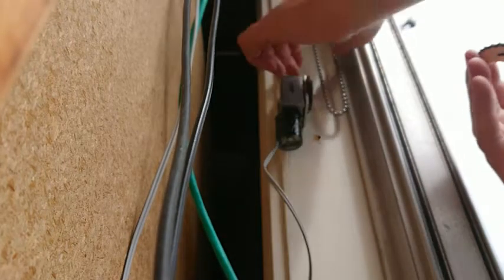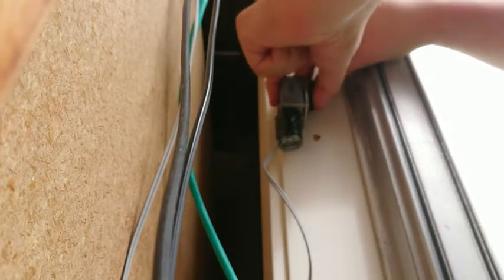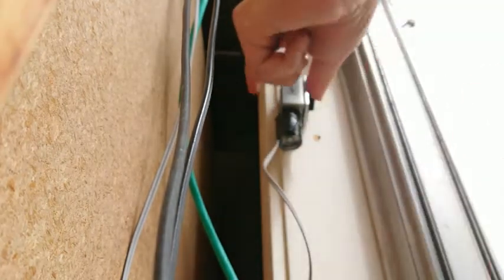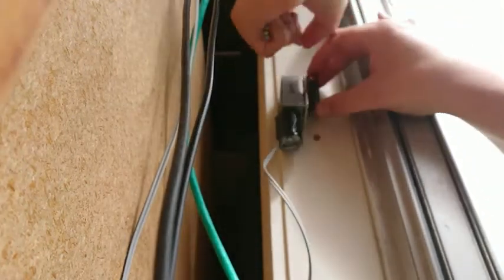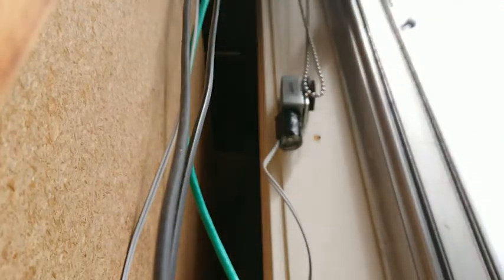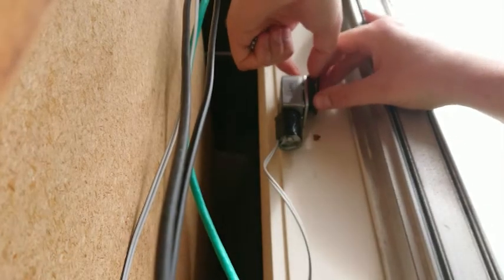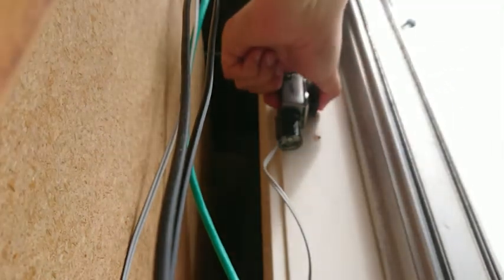When you cut with a laser there's a slight taper, so that's why I'm test-fitting these gears first to make sure I have the taper on the correct side. Let's insert and push on, and then my last piece is coming up. We'll test fit that and then leave it all to dry for a little bit and come back. Here's a little bit of glue here again — I've got the shakes at the moment, could be lunchtime. All right, assemble all this and we'll let it set.